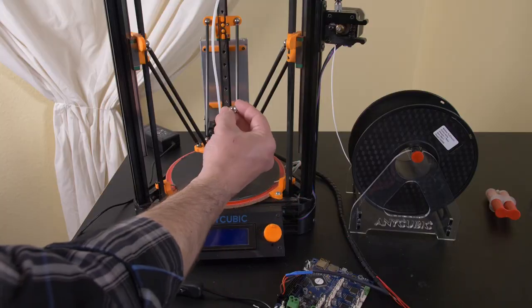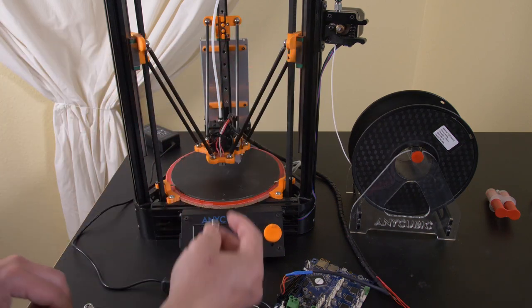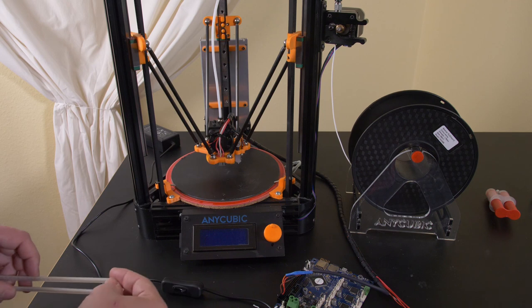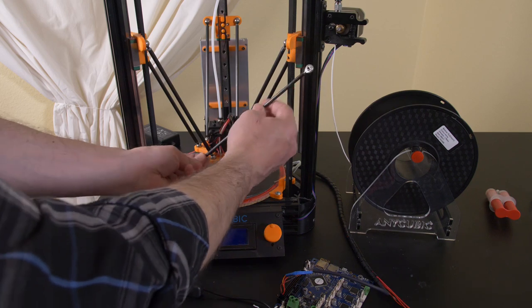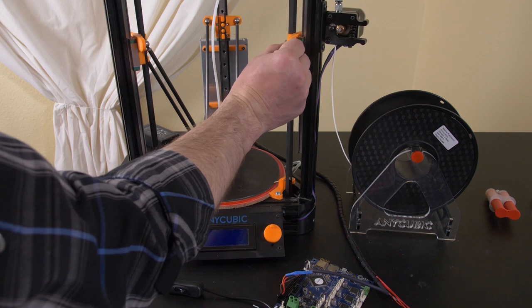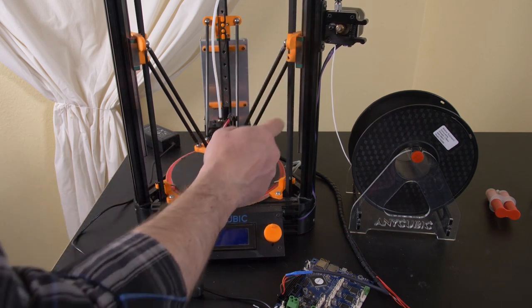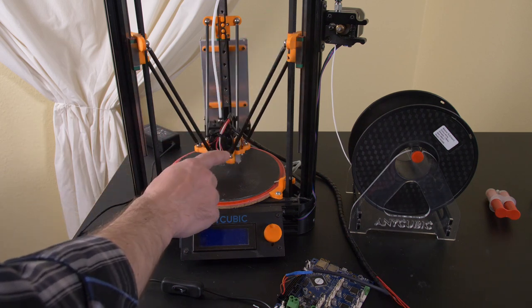But anyway, they work great to capture that ball bearing. So that's what sits in these 3D printed parts, and then the balls ride in them. And these joints definitely removed the slop that I had with the push rods, but they might not have solved the problem with the printer because I still have that slop in my linear motion guides.